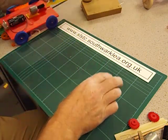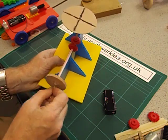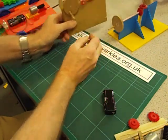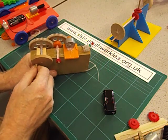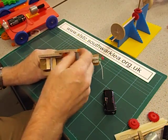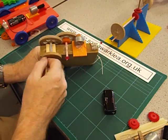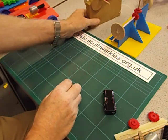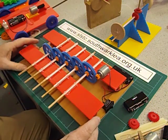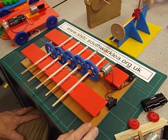The bevel gears — I would use these perhaps to make a carousel or a roundabout. Here's an example of spur gears where I've used them not to increase force but to increase speed, because I wasn't able to turn this motor — which I'm using as a dynamo — fast enough by hand. But by going big to small, big to small, I can get enough speed to actually make these LEDs light up. So I hope you found this simple beginner's guide to gears of some use, and I hope you get a chance to build something that uses gears. Thanks for watching.